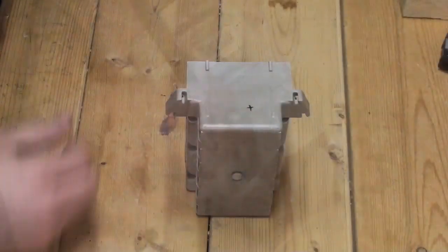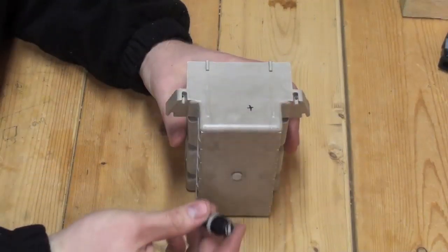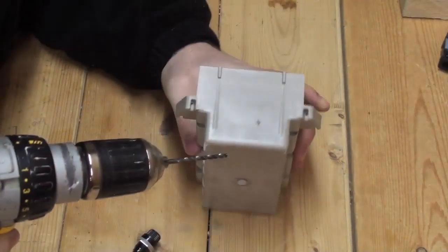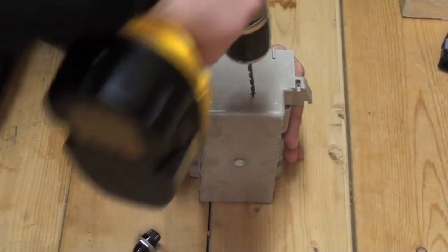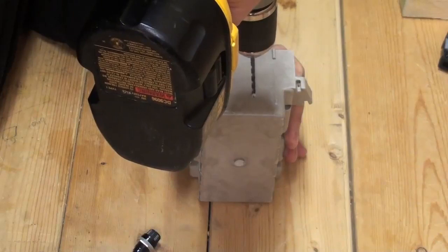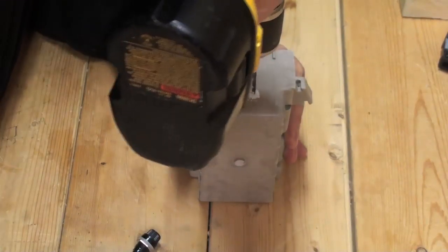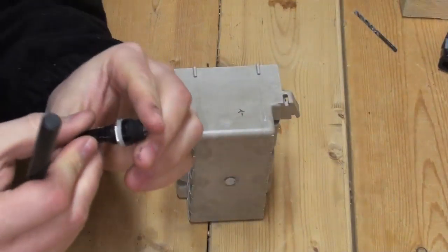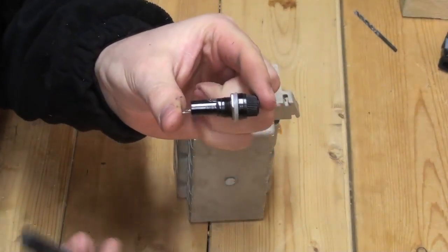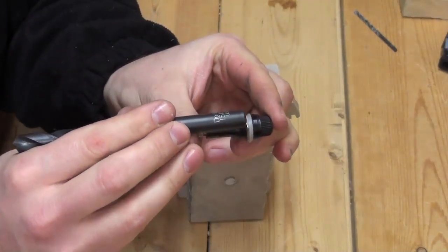A large hole will need to be drilled for the fuse holder. It is recommended to be placed towards the bottom of the box to stay out of the way of the other components. All manufacturers will suggest drill bit sizes, but this one requires a 1/2-inch bit. Using a smaller bit, a guide hole may aid in proper placement. If you are unsure of drill bit size, you can always select a bit that covers the threads of your fuse holder.